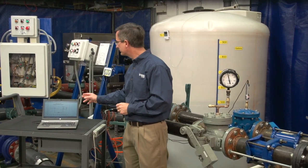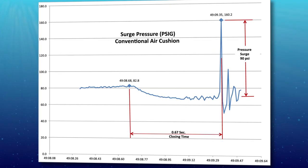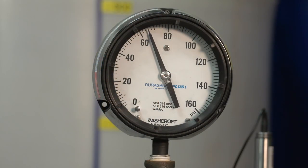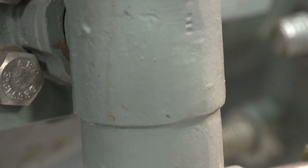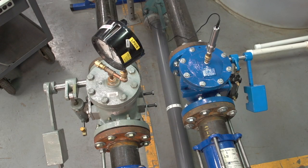Looking at the laptop results, we can see that the pressure surge was about 90 psi over the static pressure in the tank. Also, the valve closing time was about 0.67 seconds. The reason we heard a slam is because the water flow reversed and went backwards through the valve before it closed. Then when the valve closed suddenly, it stopped the reverse flow almost instantly, causing the water hammer. The solution to preventing slamming is to get the valve closed before that reverse flow can develop. Unfortunately, a conventional air cushion tends to slow down, not speed up the closure of the valve. This allows the reverse flow to increase, and then when the reverse flow pushes violently on the disc, the air in the cylinder is compressed and therefore cannot prevent the disc from rapidly closing and causing a slam.